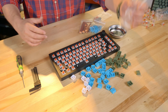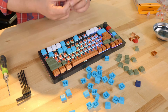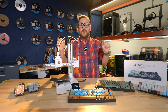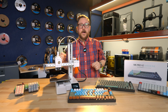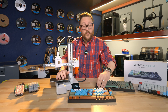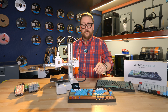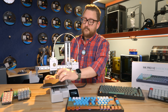Let's go ahead and start inserting some keycaps. Now that we've got it back together, a big shout out to our designer Studley Avocado, who actually designed these. When I downloaded the source files, I want to show you how they were oriented to print. The designer had them oriented so that they printed here and his keys came out really nice. However, when I downloaded them I decided to print them differently. That's okay for keys that have a flat top, but for keys that actually have a slope, the layer lines become very visible, just like on the space bar. Following Studley Avocado's directions and printing them in the orientation they come in the file will get you a nicer result.